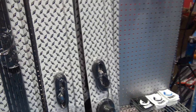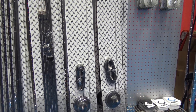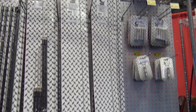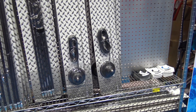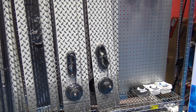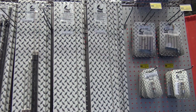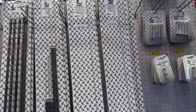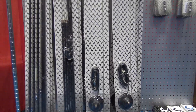This is the 5/8 wave mag mount, monoband — 48-inch whip, 2-meter. I remember when he first came out with that, he sent one to me. With that antenna on there — it's still on my truck, it's still hanging on, it's been whipped a lot, it's still got a low SWR — and I've been working simplex contacts sometimes 30, 40, 50 miles away with that 5/8 wave. Sometimes it's better for simplex than for repeaters compared to a quarter wave antenna, but it really gets me some long range.